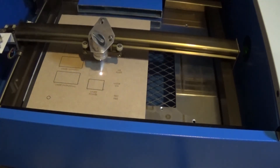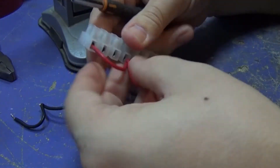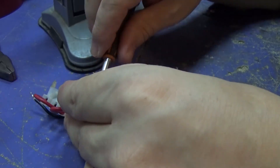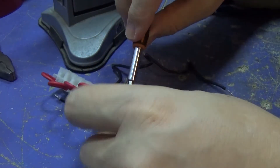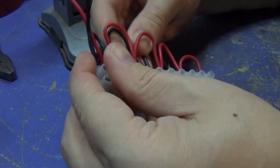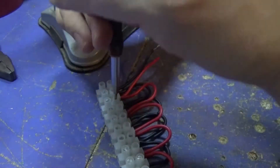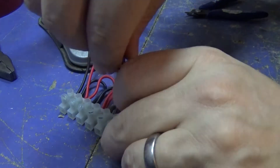What a lovely amount of smoke this is producing. Here I'm actually making a set of wires to connect all the DC to all the different things. I decided to do it this way rather than plugging them all into one block, so that I can have them all labelled and if something breaks I know exactly where it is and I can just unplug it and plug the replacement in. It's a little bit more hassle but it makes things much clearer.